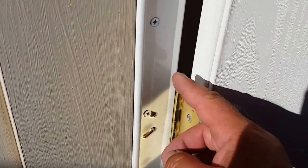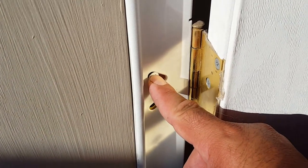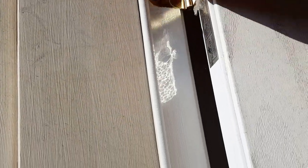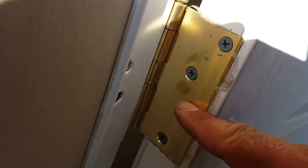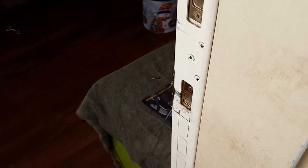Here are the hinge shields. Basically what you do is take out one screw of your existing hinge and replace it. These screws are about three and a half, maybe four inches — extremely long and very well protected. I recommend buying additional screws so you can do all the other screws as well for better peace of mind. You might also want to get longer screws to cover the actual inside door. You'd be surprised how small the standard screws are and how easily a door can be broken through.